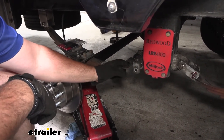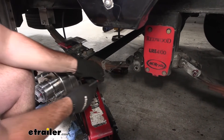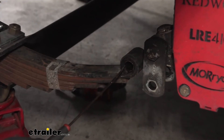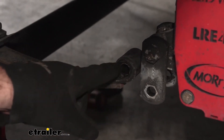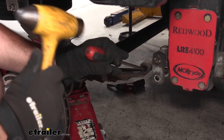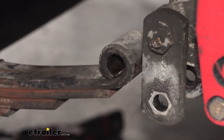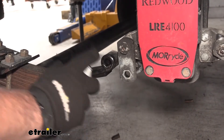After you get that bolt out, there is a bushing right inside of there. This one is what I was talking about — it wasn't getting grease. You can see right in this area where it's broken. That can cause a lot of damage. So we need to take out that bushing and replace it with a new one. Take a flathead screwdriver and tap it out until you get it all cleaned out. You can see how it's breaking apart. After removing the old one, spray some lubricant in there to make sure you don't have any particles remaining.